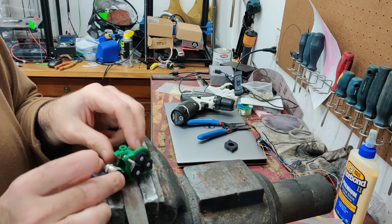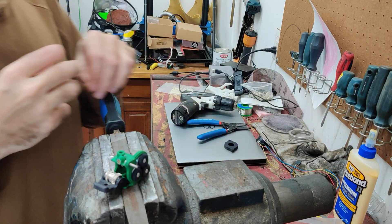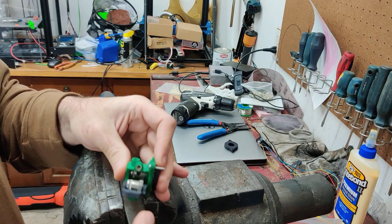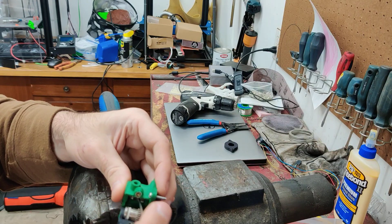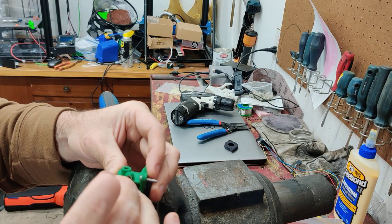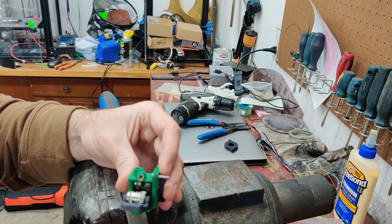Here's one of my Orbiter extruders — I print my own because I often need it to be mirrored, and the online sellers don't seem to sell them mirrored. The first thing we're going to do is loosen the inside hob. Here is the grub screw that holds that hob in place — just loosen it enough so that it wiggles side to side on the shaft, but still stays exactly where it needs to be on the flat of the shaft.